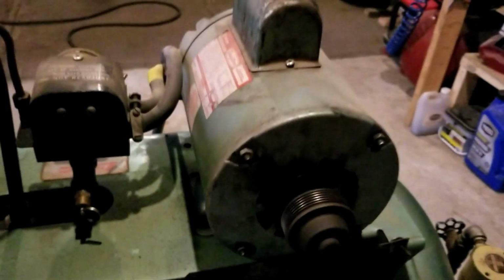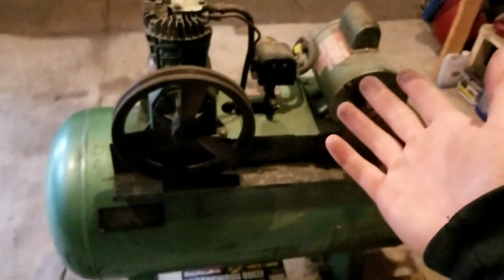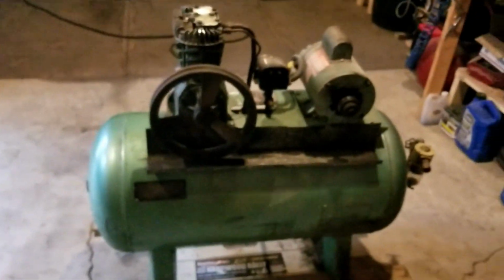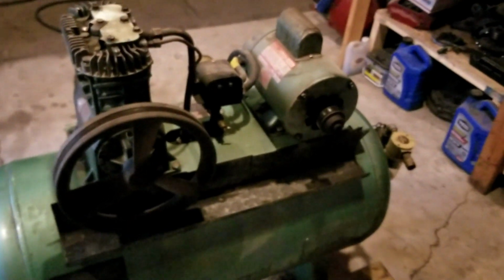It doesn't sound great, and when you spin the spindle, it feels real crunchy. It couldn't really start this up, and it's only like a 12 amp. That generator should more than start this, so I think I'm gonna order a motor too, I guess.